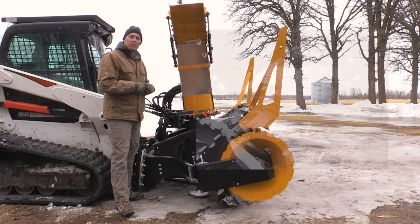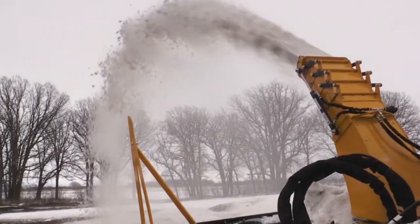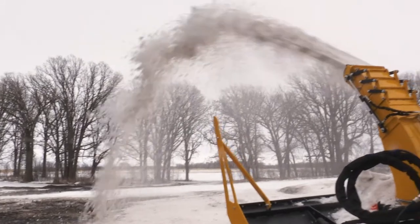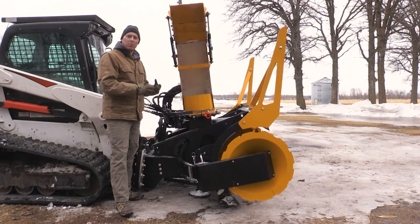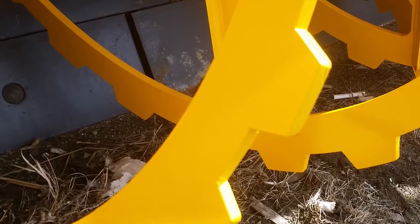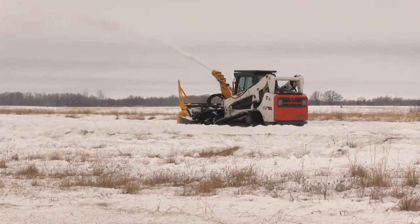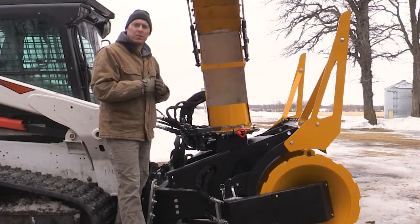On the backside of the snowblower is where the fan motor is located. On this extreme snowblower we're using a five-piston radial design motor that gives high efficiency and is able to accept high flow rate and high pressure. The performance difference is quite noticeable from the cab — when a typical geroler motor might start slowing down, the piston motor keeps pulling through with tremendous torque even at lower speeds. You notice that even as loading rises and you're blowing more snow, the difference in casting distance is not as pronounced. Inside the fan wrapper we have a 3/16-inch thick AR400 steel liner to protect the fan wrapper from wear, for customers using it in conditions with sand, gravel, or other abrasive material — it gives a wear surface that can be easily changed out.